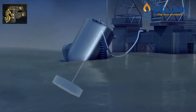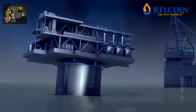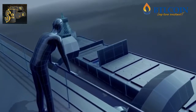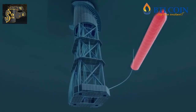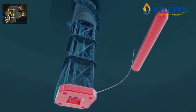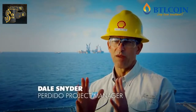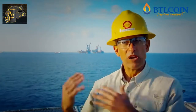Once the bottom half is in the upright position, it isn't very stable. As soon as the deck is added, the rig gets very top-heavy and could easily flip. The solution is 13,000 tons of pulverized iron ore. This is pumped into a tank at the bottom of the spar, which gives Perdido an extremely low center of gravity, so it becomes impossible to flip. When we put that weight in the bottom of the spar, it's inherently stable — it's not going to flip over or get out of alignment. Other floating structures face real weight and stability issues, but we don't have that problem on a spar.